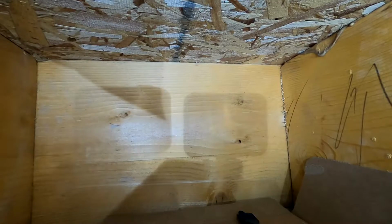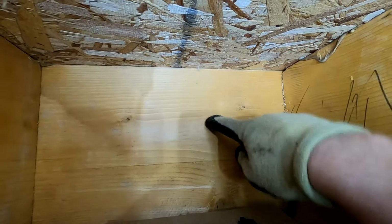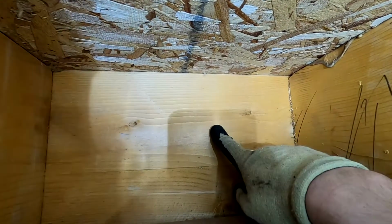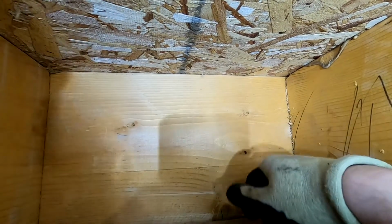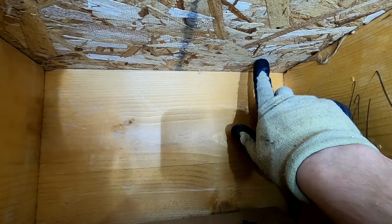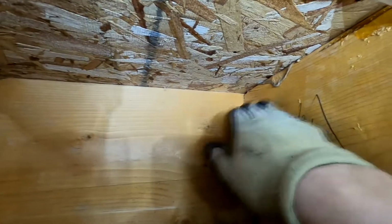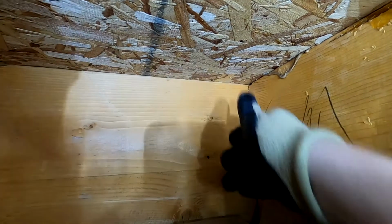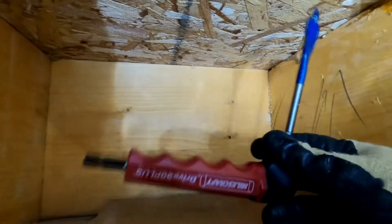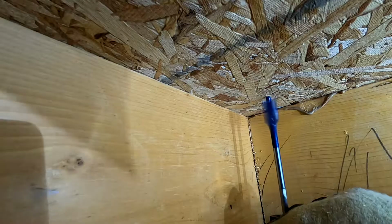That'll do. So this is the spot where I bring the cable from the basement into the garage. Right behind this wall right here, or this board, is the garage, but because I am putting my outlet about 16 inches up into the wall, I need to drill into the cavity and fish the wire up. Right here should be the stud that's in the garage, and obviously I have a stud right here. So if my calculations are correct, this is where I need to drill up. Obviously I can't get my drill in here, so I have this little 90-degree adapter and a 3/4 inch bit, and that should work.